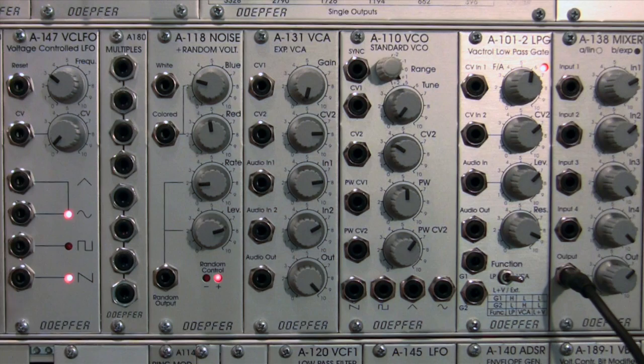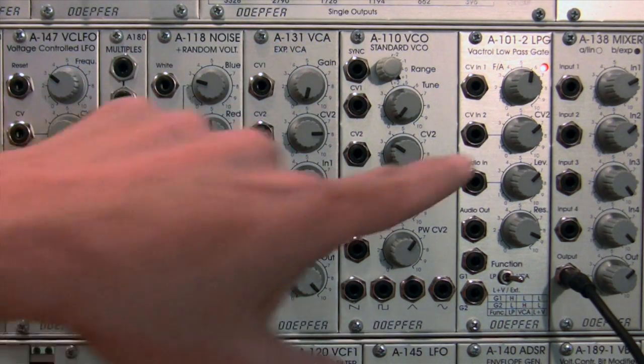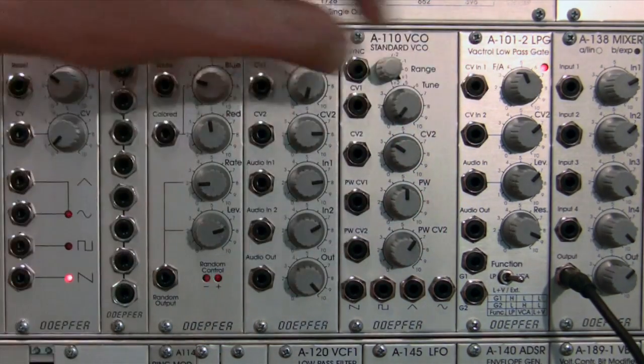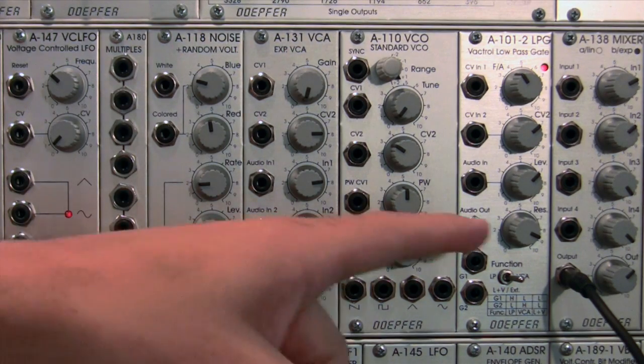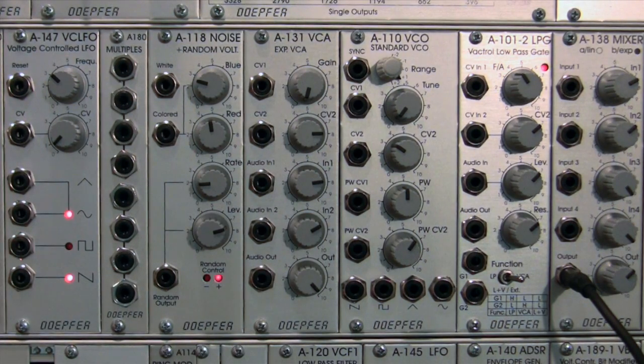Then, in the second part of this particular demo that we did, we actually fed a modulation signal into our CV and allowed it to adjust dynamically the amplitude of our signal, rather than us having to manually stand there turning and turning our VCA. We could have it dynamically change it, and you could adjust the frequency of our LFO, have it go faster or bring it down, have it go slower, as well as a mild overall loudness here on our A101-2.